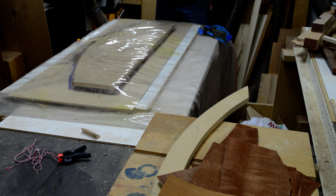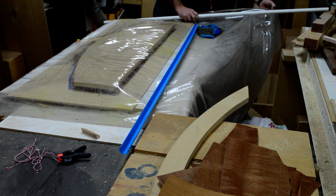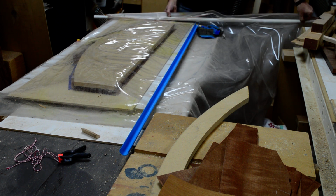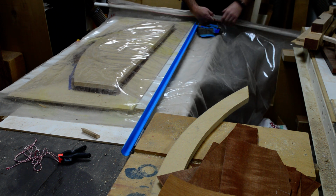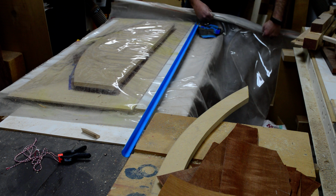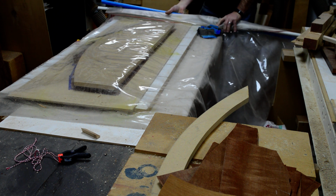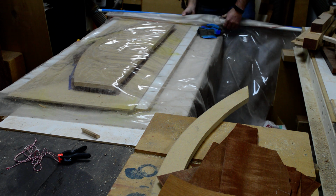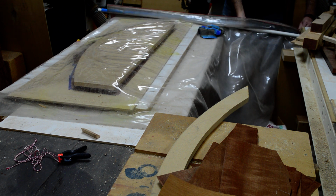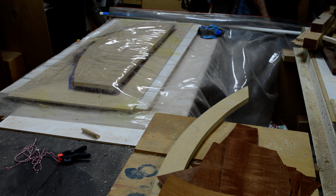As much as I can, I want to make sure that the trip into the vacuum bag is as quick as it possibly can be from the time I apply the adhesive to the first side of the substrate. The longer I let that glue set outside without any pressure, it could start to develop some pretty nasty habits like different wrinkles and introduction of moisture on certain spots of the veneer but not others. So as much as I can, I want to make sure that I've got good preparation, getting it in as fast as I can. And right now, I'm clamping this into the bag. I'm trying to get out all the wrinkles from the vacuum bag because that's an easy way to let air in.